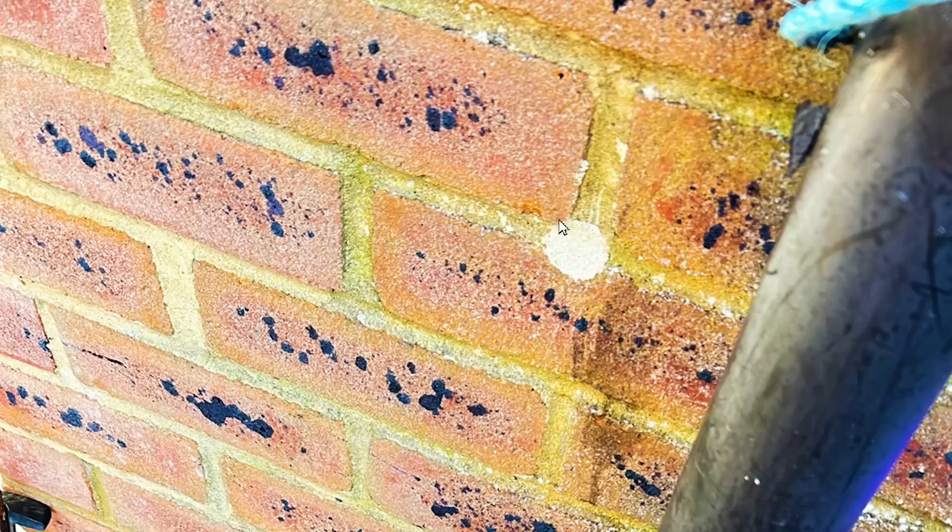There's nothing wrong with cavity wall insulation if you're not in an exposed area and the masonry looks intact with good pointing. If there ever were a problem with cavity wall insulation, a quick coat of Storm Dry over the bricks would stop any penetrating damp. I've done that on a number of occasions where driving rain was soaking in - one coat of Storm Dry and it's back in business. Anyway, you can tell from the holes in the mortar that somebody drilled and pumped in cavity wall insulation. I hope that helps Allison, and hopefully your friends and neighbors will no longer think you're a nutcase!